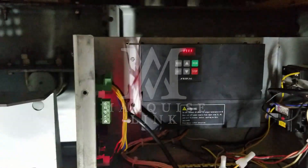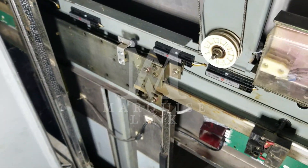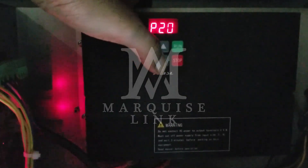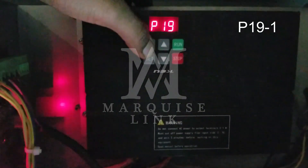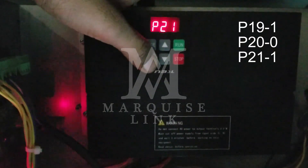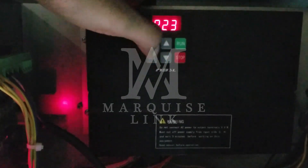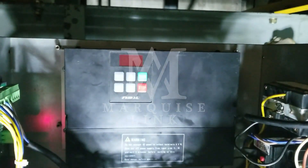To correct this, we will bring the door into the center of these sensors, and at the center point not a single LED should light up. If it's not happening, we will change the value of P19 to P22 to get the desired status of the LEDs. And now you can see that after setting them, we have been able to get the desired outputs.